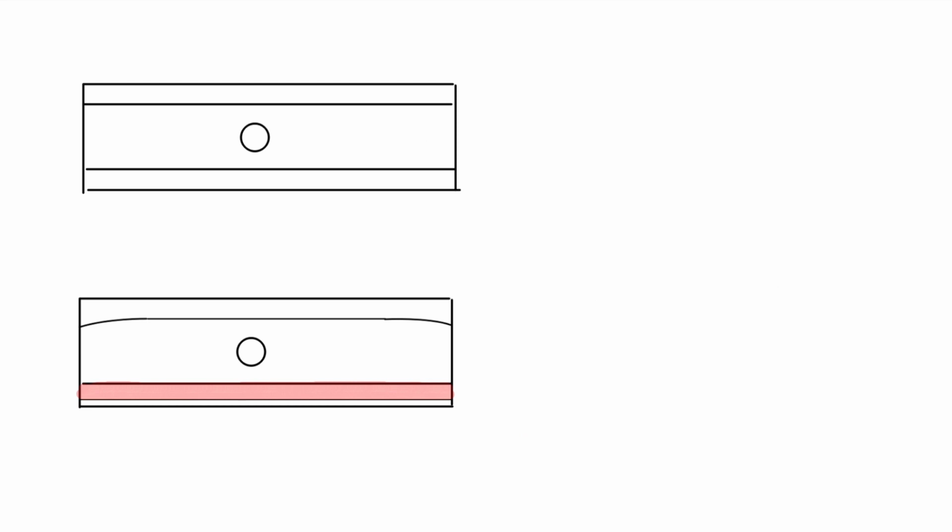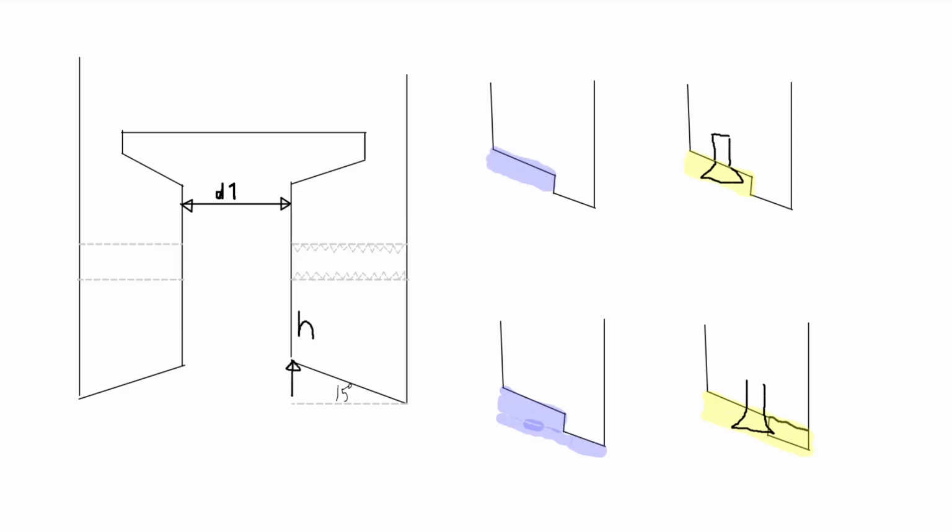And that is why over time the front gets worn down here, this area. So you only have the middle where it's kinda okay. We can use the middle to get our height here. We can measure that. This is the height there, and we know how much to add to our worn out area. But of course, for machining this is no good. So I tried to find a different surface.